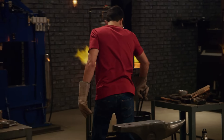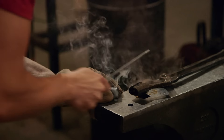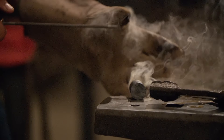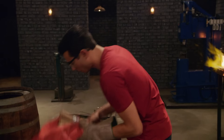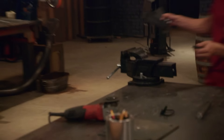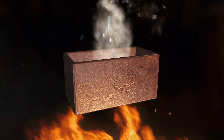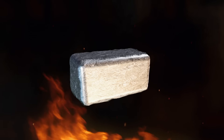The file does not skate at all, which means that that's not hardenable steel. I need to think of a plan B. Light bulb goes off — throw it in a canister. I'm just going to cut off pieces of steel, and I'm going to throw all of it into a canister with some 1095, and that will hopefully give me a solid billet.